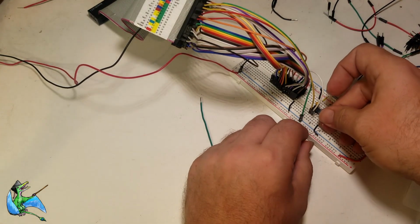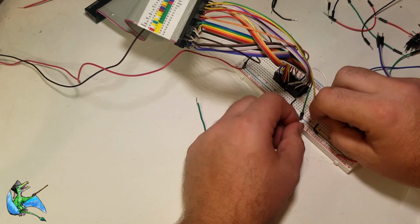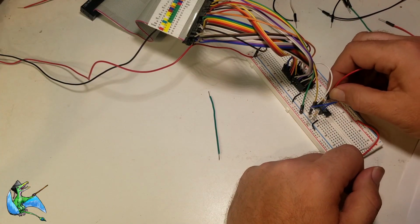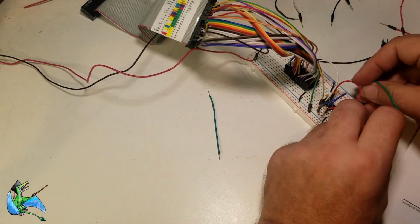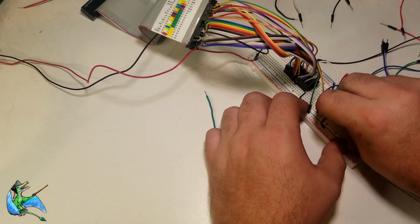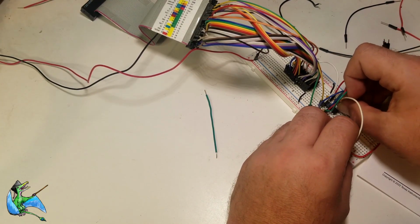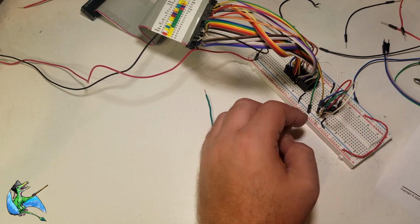But since most logic chip selects are active low, we need to invert the state of A15. So CE goes low when A15 is high. And that's all we need. If the computer's address bus indicates an address with A15 set high, then the memory chip will enable itself to drive the bus or answer a write request when the TRS-80's memory read or write signals also go active low. When these conditions are not met, the memory chip will simply stay asleep.